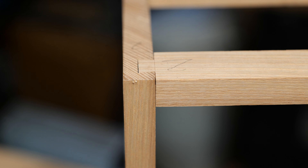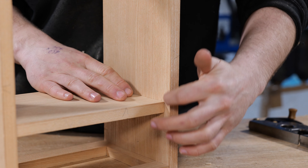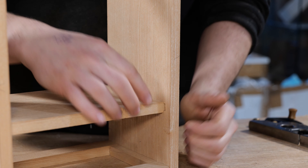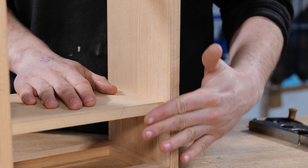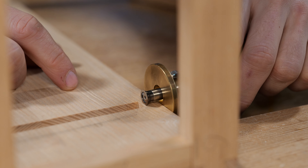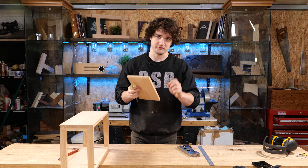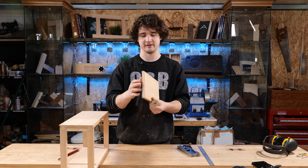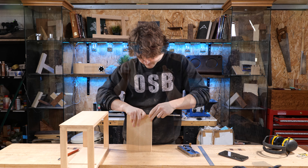You can see we've got a few small gaps along the edge of the shelf, which is completely predictable — that's because we haven't closed up the gaps on the dovetails just yet. They just need a little press end to end in order to close them up, and that will close up everything happening down here as well. The shelf isn't getting to the front of the cabinet because we cut a stopped groove, so we need to cut a little notch out of the end of the tongue to allow this to become flush or just slightly overstep the front. From the front edge of the cabinet I'm going to set a marking gauge to the end of the groove plus one millimeter, which will allow the shelf to come out beyond the front so we can plane it flush afterwards.